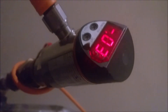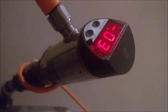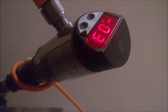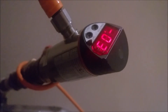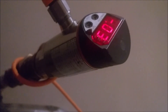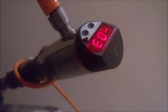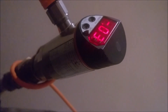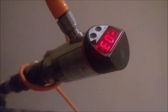After four and a half hours of working, my filter starts to get a little bit dirty. The under-pressure gave up 10 millibar, which is not dramatic, but I must keep an eye on it. I will probably shut down now at five hours and then restart — five hours on, restart, five hours on — because frequent starts give the dirtiest gas. That way you can totally get an idea of the lifespan of your filter.